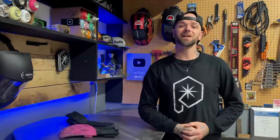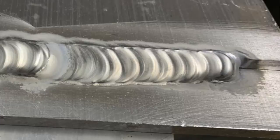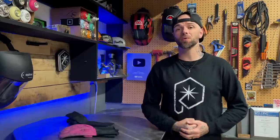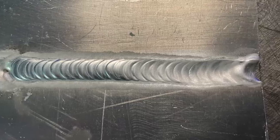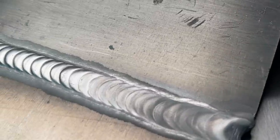The second most common thing I see in relation to standoff distance problems is exactly what we see here. Looking at a lap joint where the start looks one way and by the end it looks completely different — and the same with a butt joint. As we begin to move throughout the length of our weld pass, things are completely different near the end compared to the beginning.